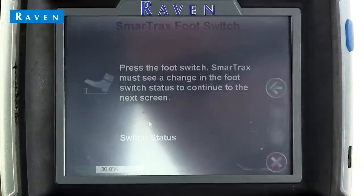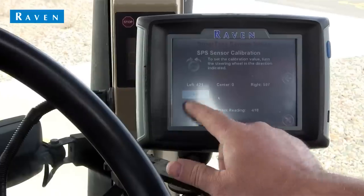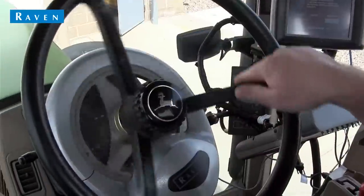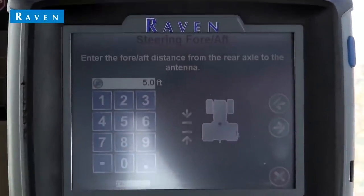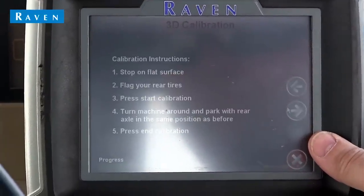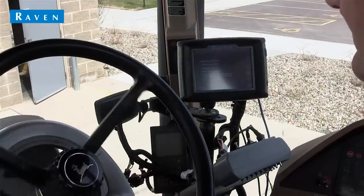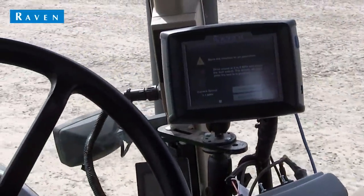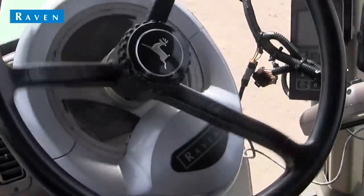After that is a quick check to make sure your foot pedal is operational. Next up, we have our steering position sensor calibration. All you have to do is turn the wheel all the way to the left and press Set, and repeat the process to the right. Next, we'll enter in the distance to our GPS antenna from the rear axle, followed by the height of the antenna to the ground. After that, we'll take care of our 3D calibration by following the on-screen directions. With the 3D calibration complete, the final step is a quick steering test to complete the calibration. The machine will steer itself during this time, and it only takes a minute to complete.